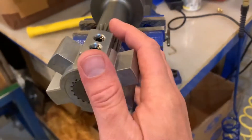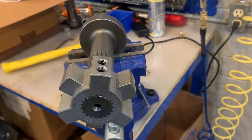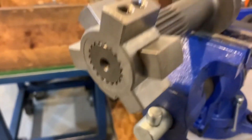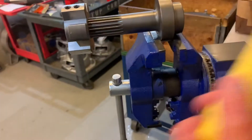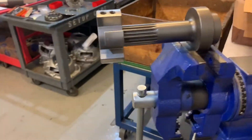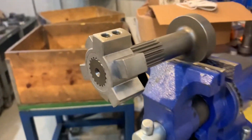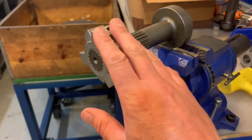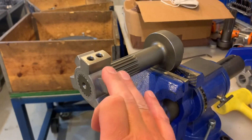Even before I take these to 25 foot-pounds, this is not going to come off. We'll torque these to 25 foot-pounds and show you they will not come off. Now with the set screws torqued to 25 foot-pounds, still fairly flush with the end of the shaft, we're just going to start tapping on the end — and that is still flush. We put this in a push-out test with hydraulic cylinders and it takes anywhere between three thousand and six thousand pounds of force in order to move this hub on the shaft.